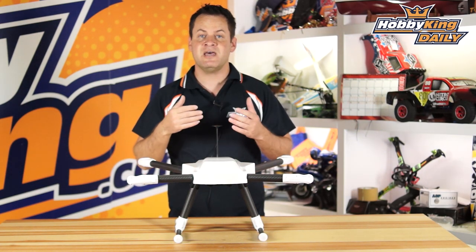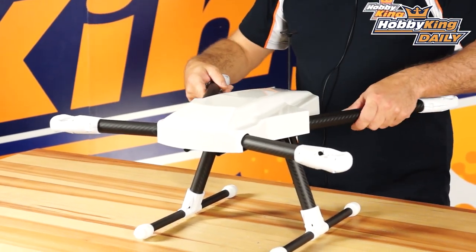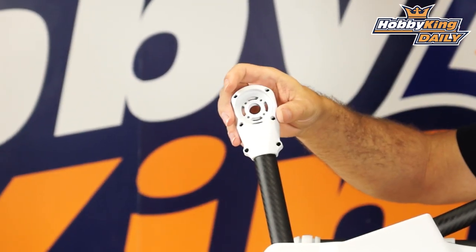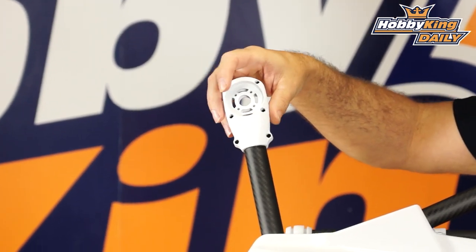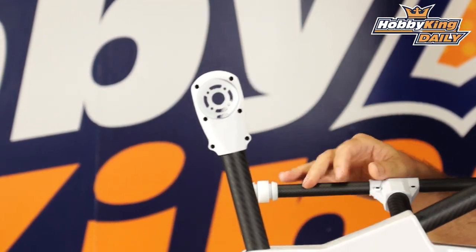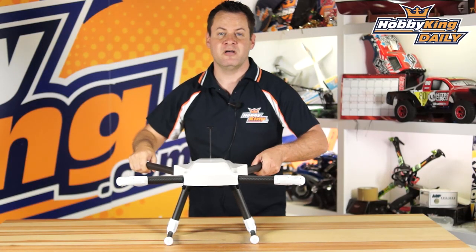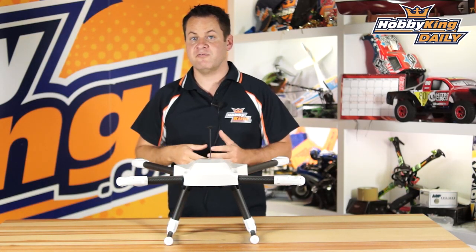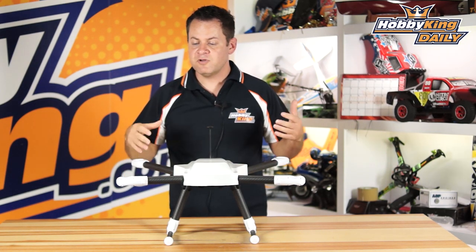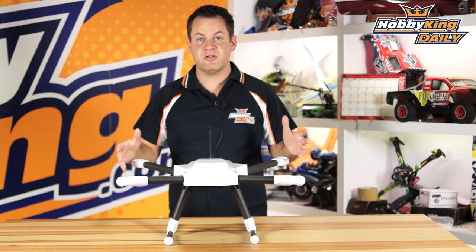It's very good for redundancy, and the X8 configuration is awesome for heavy lift. Going back to these motors, this right here is 43.5 millimeters in diameter for the recess and drop down, and the motor wires have a slot to go ahead and drop in. That 43mm allows a fairly large motor — if running as a quad, up to a 3508 or 3510 style motor. If running in an X8, something like a 2810 series motor.